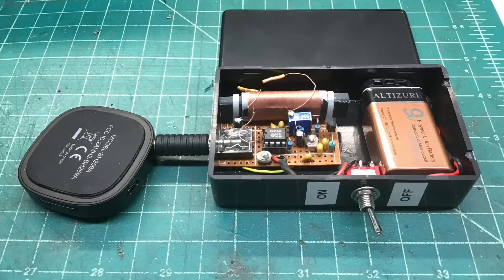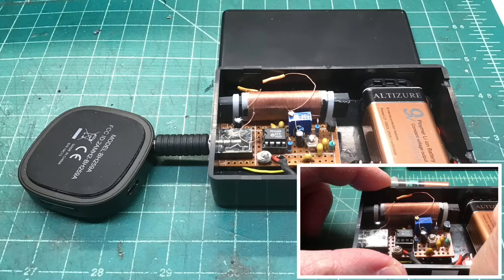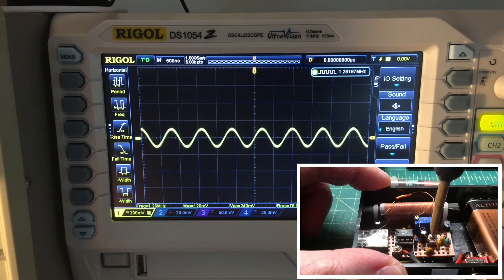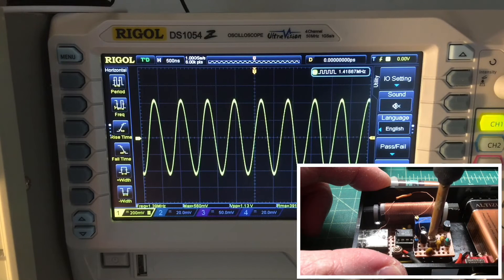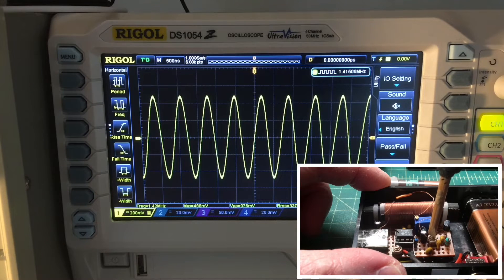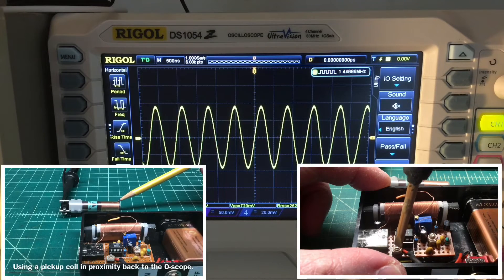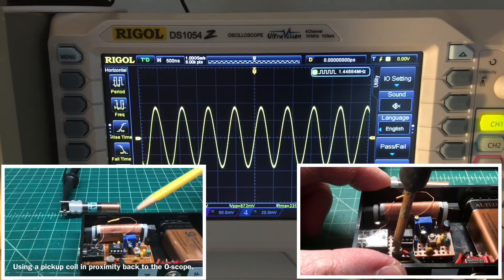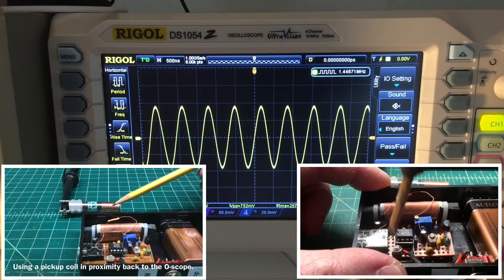My circuit layout can be better optimized — this was only my prototype build. Let me point out just a few adjustments on the board before reviewing the schematic and BOM in detail. You're looking at trimmer C3, which is in parallel with C1. This allows me to adjust the frequency from approximately 1150 to 1470 kilohertz in my design. You can see the second tank circuit, L2 and C7. I'm adjusting trimmer C7 for maximum output based on my setting of C3.